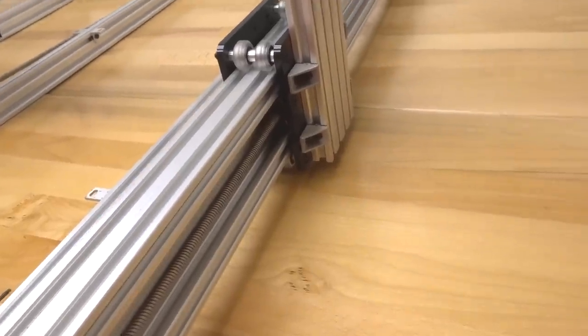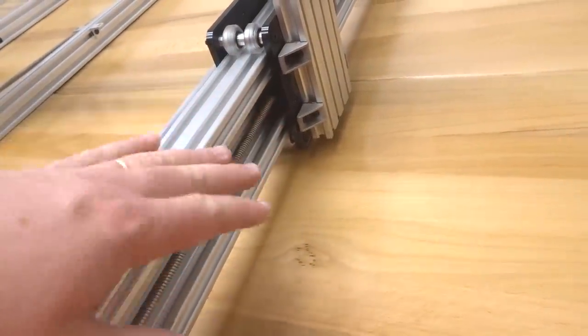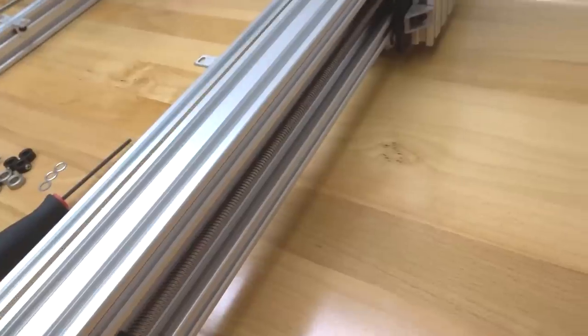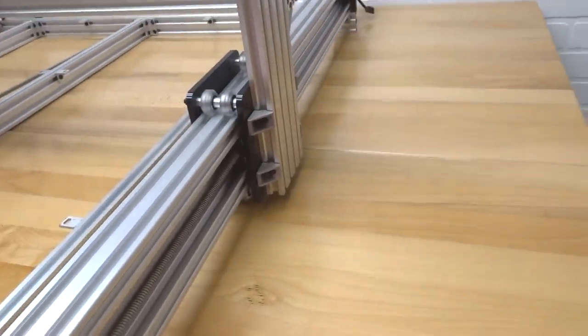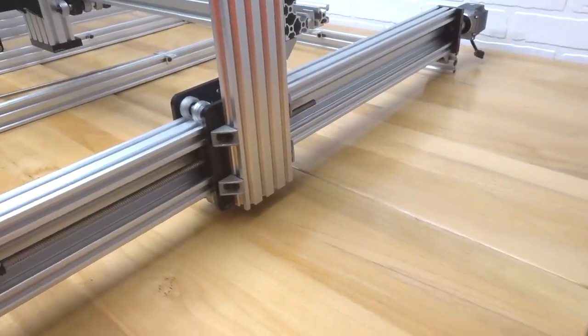We still have these nut blocks loose, remember? We're not going to tighten them down until we get this lead screw completely through and seated properly, and I'll show you that step here in a minute. So just keep rotating this down until we reach the other side. Once you see that the lead screw is exposed, we're going to add our additional parts,